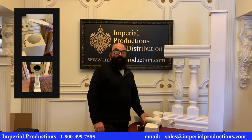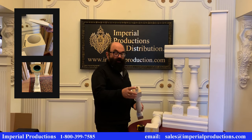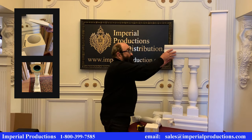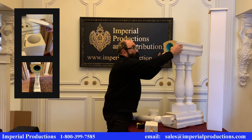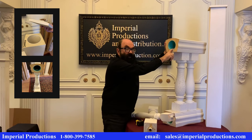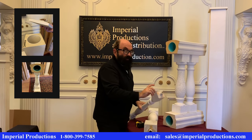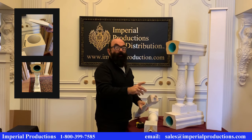In order to be structurally sound, the balusters have an internal support as well as the top and bottom rail. Inside there is a PVC pipe in the top rail and the bottom rail, and also a PVC pipe or an aluminum pipe within the balusters.